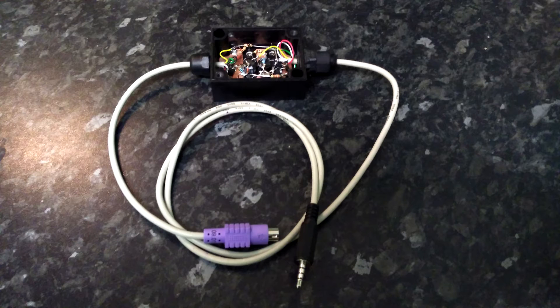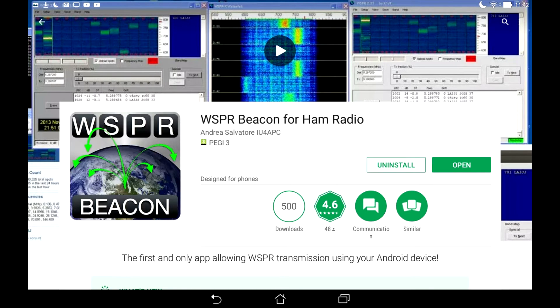I run it on an FT817 and I've been testing it on 500 milliwatts on a program called WSPR. Here's the app that I run on my tablet — it costs about £1.54 at the moment, so excellent value. It's the Weak Signal Propagation Reporter, known as WSPR for short. It works fine; you can use it to get signal reports from other stations. It's all automatic — you just set it up and leave it to run.